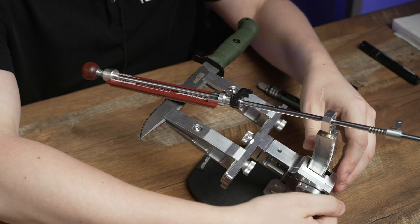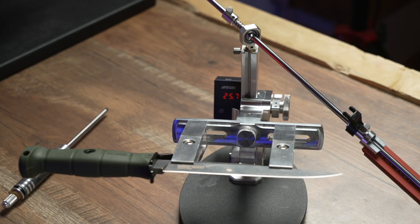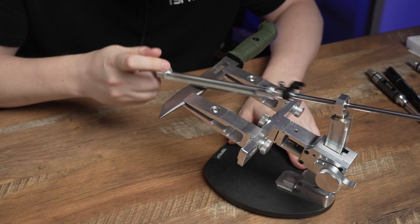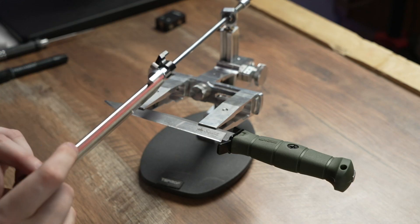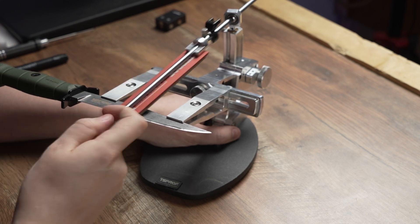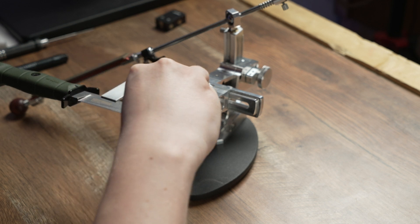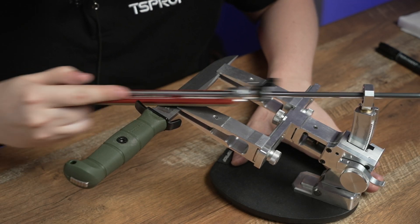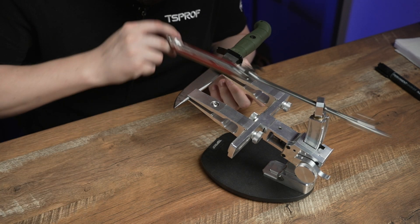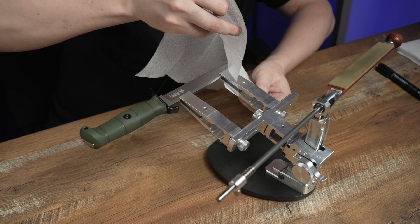To test how this steel performs during the sharpening process, we decided to change the factory angle from 52 degrees to 42 degrees. To sharpen it, we used three-layer diamond plates to give a new shape and angle to the knife, and alpha abrasive stones to shape the cutting edge itself and for finishing operations. Sleipnir steel processes easily and may be sharpened with any abrasive stone you have nearby. The most adequate finish for a Sleipnir knife would be a stone no finer than 7.5 — a finer finish will lead to loss of cutting aggression.